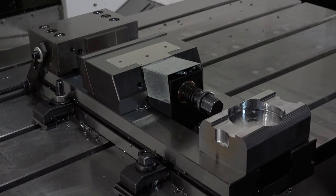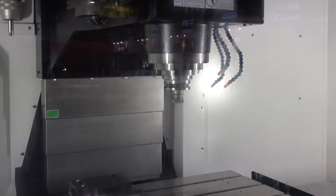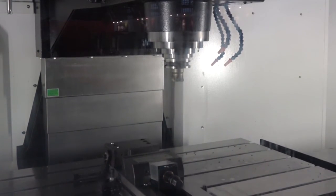On the spindle — do you have through spindle coolant on these machines, and is it standard or an option? And regarding accuracy on heavier parts, do you use scales to maintain precision? Scales is an option, but the standard specification includes through spindle coolant, chip conveyor, and rear tool loading — because on machines of this calibre, you have to load through the spindle. On the Hartford range, the rear tool loading option is brought in as standard, so you can load from the rear of the machine.